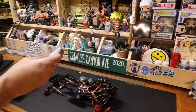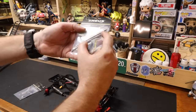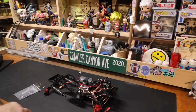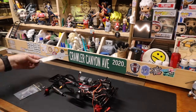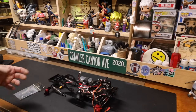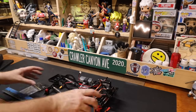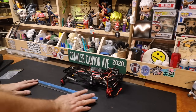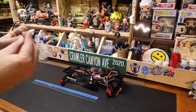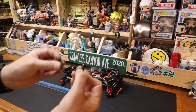When I say that, my measurement that I use is what I call shoulder to shoulder, is there to there. Here's a little insight: I would set the axle right there, grab a ruler, and try to measure roughly from eye to eye. That eye to eye is roughly 150 millimeters. So we take our buddy Victor, the big ruler. It can be a ruler of any size. You obtain 2 of the rod ends that you will be using, and I will be using the angled ones that come with the links.